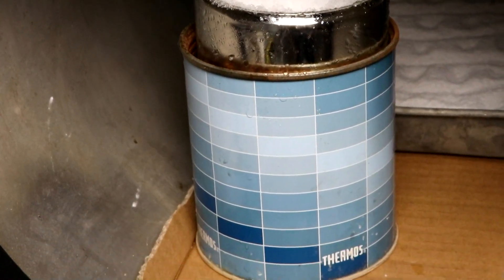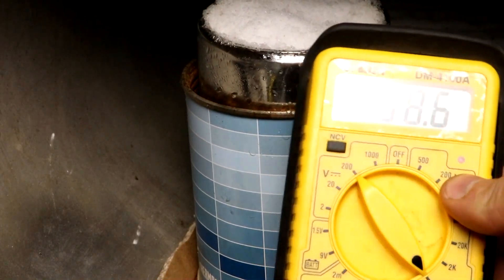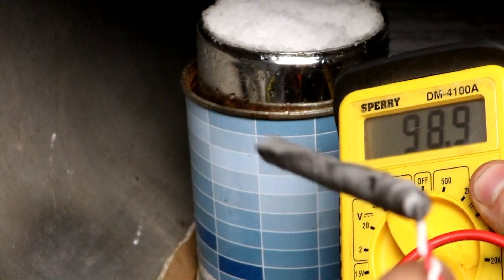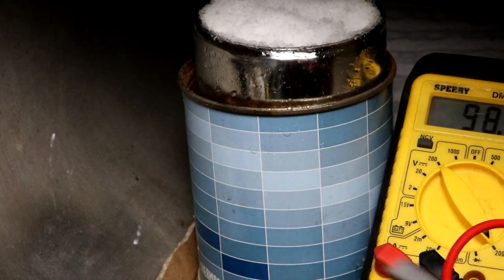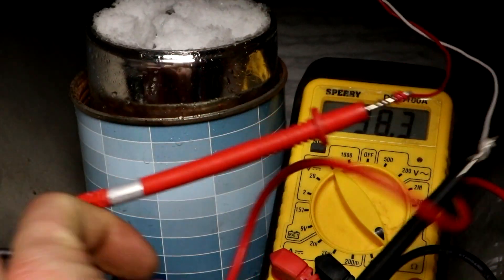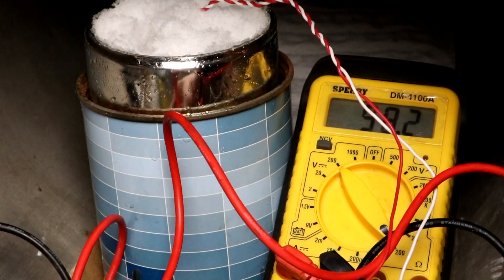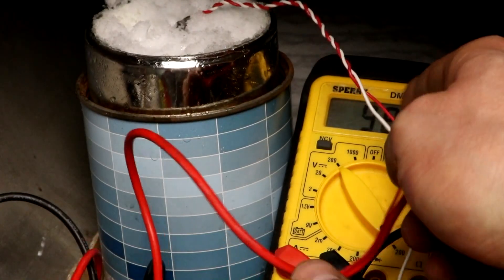Let's get this switched out for a cup with some snow and a thermometer. So I filled up an insulated flask with some snow, and here's my thermometer — I'm just going to use my homemade thermometer that uses a multimeter and a coil of copper wire. This is measuring the resistance of the coil displayed here in ohms, or 'degrees Cody' as some people have said. I stick it in the snow; we should see a bit of a temperature drop as it goes down to the freezing point of water. I'm going to pack all these wires in here so that I can close the door. There's really nothing in there that would be affected by the vacuum except for the battery, and I've actually dipped that in some acrylic resin.